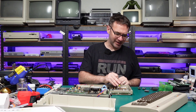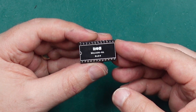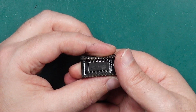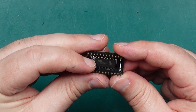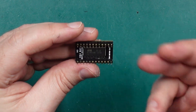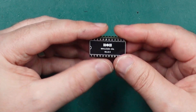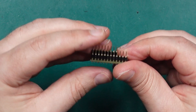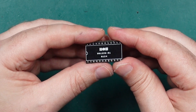So as I mentioned, the top is plain apart from the logo and part number, which means all the magic must happen on the underside. And there we go — what we have here is an Atmel AT28C64 EEPROM. This just holds a copy of whatever ROM it's designed to replace, and I added a bit more text on the underside. After that it was just a lot of careful routing to try and keep all the traces off the top side and give it the cleanest possible look.